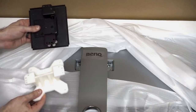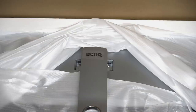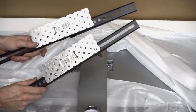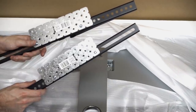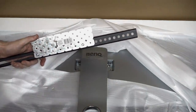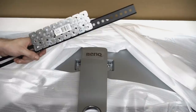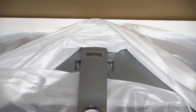I'll make the link available to the CAD file as well as a 3D print file I found on Thingiverse. You could also go to a fabricator and have something made out of metal. For mounting to the Next Level Racing stand, I've taken two of the mounts that come with the stand and installed a couple of small brackets from the local hardware store — part number VBM1060, which is a 60 by 200 by 1 millimeter mounting plate. The really useful thing about this bracket is that the stock mounting plate has 100mm spacing between screw holes, and this bracket also has 100mm spacing, so it lines up absolutely perfectly.